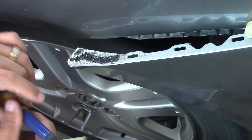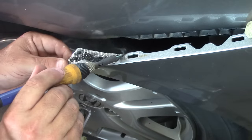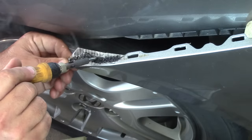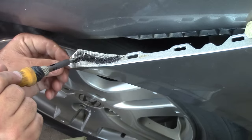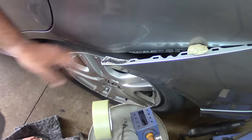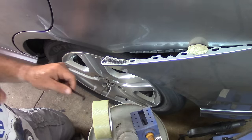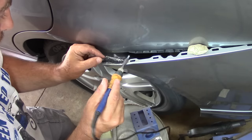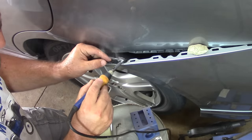Now I'm going to dig a little trench out of here. I let that cool down and it's pretty solid. What's cool is the tape melts but the fiber in the tape does not — some of it gets burned but some of it doesn't. This is the filler strip made from the matching plastic from the lid, and I'm going to take it where I dug the trench and just run it on top for strength.